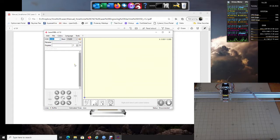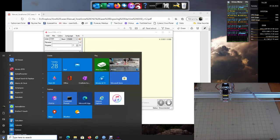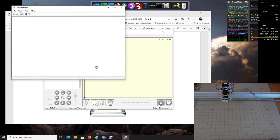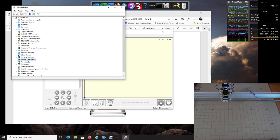Now we need to know where that driver is installed — which COM port. If you have Windows 10, go down to the Windows button, click it, and start typing 'device.' You'll see Windows automatically pulls up Device Manager — click that. Go down to Ports, click the arrow, and look for USB Serial CH340 COM port. Mine is COM 7, so that's what I need to know. Yours might be different.